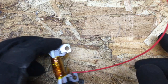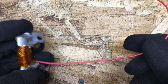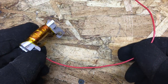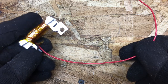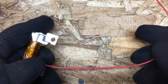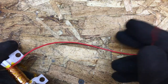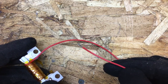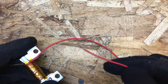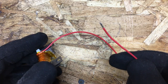The cool part about this generator is that it has its own coil, so it allows you to run a separate wire for your lights and not lose any power for your spark. But there is one thing I'm going to fix on this first — it has a pretty small wire and it's also made out of steel, not copper, so it doesn't conduct as well.